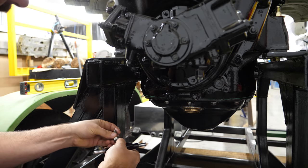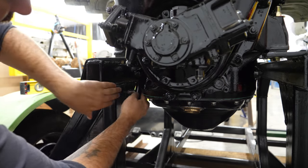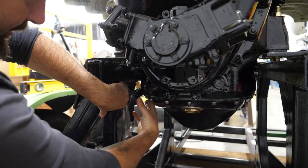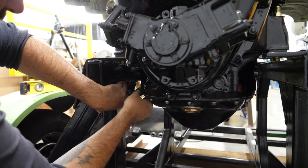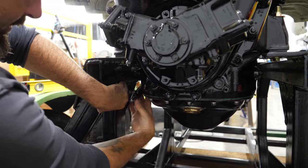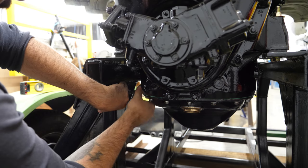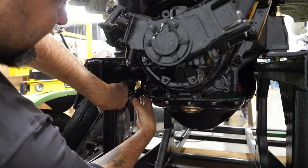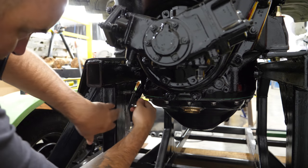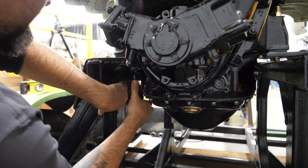Now go ahead and put this back here. I can hold the bushing flush to the face, making sure that the tap is perpendicular to the work surface, and I'll hold it there and make sure that it goes in. I'm using a tapered tap right now, so I want to make sure that I've engaged the full diameter of the thread on the tap before I really let go, just to ensure that everything's sitting as true as possible.